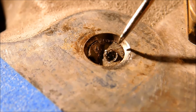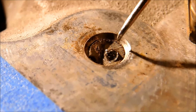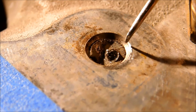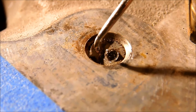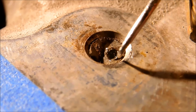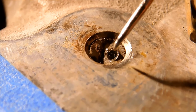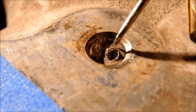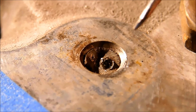We want to go to the size of the pilot drill hole for the internal thread, not the external. If we can do that, then I can grab a hold of this and pull it out like a spring. If there's anything left in there, it's going to be one piece and it's not going to want to do that. So you can pass a drill down through here and create a spring out of a broken stud like this. And sorry for the wobble, guys.